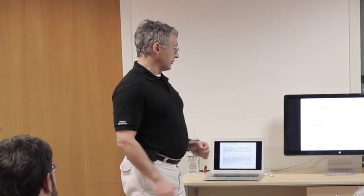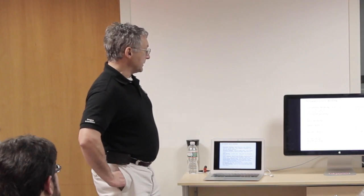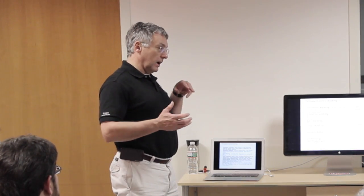Vibration welding, we mostly don't see that. It's basically friction welding, like spin welding. Laser welding, so you can send IR laser right through one of the parts if it's transparent to the IR laser and weld the interface.